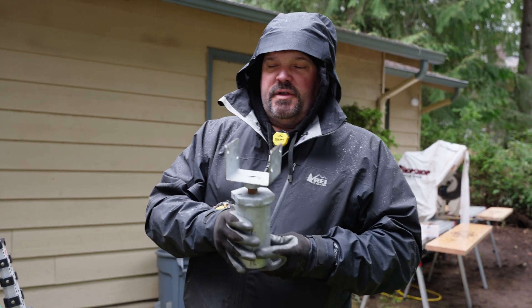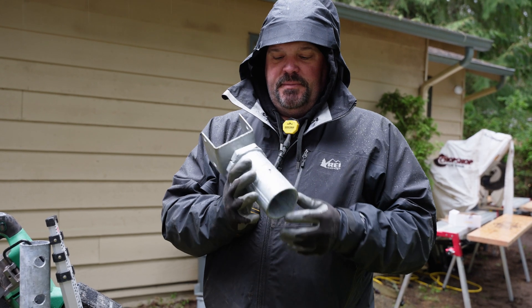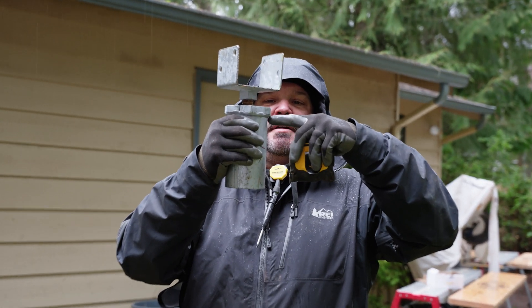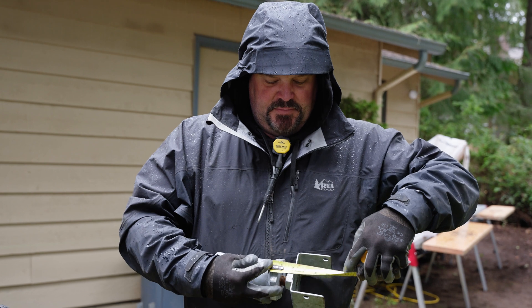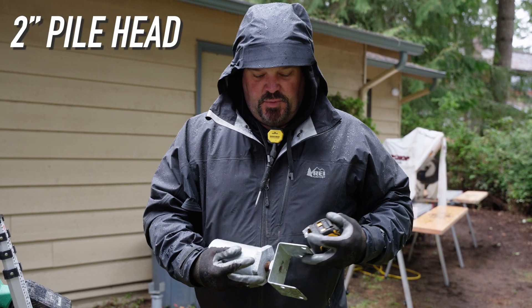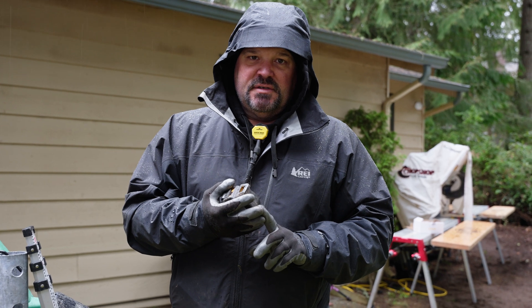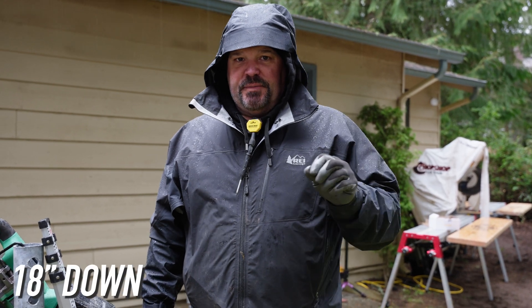What we need to know is where to cut the top of the pile off so that when we set this bracket down on top of it, it sits flat right on the inside. We're basically measuring to right here. We need to know how much distance that is - it's about two inches that we add into the equation for elevation. So we have two inches for the pile head, the adjustable head; one inch for decking; seven and a half for framing; and seven and a half for our beams. That's 15, 16 inches plus the two inches for the pile - so we need to be down about 18 inches from the green laser line to know where exactly to cut.